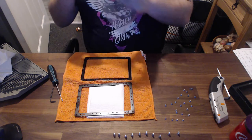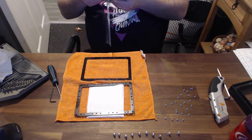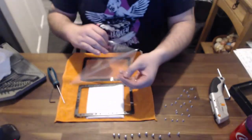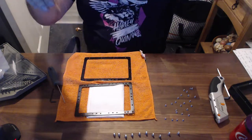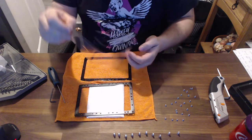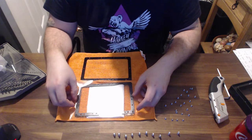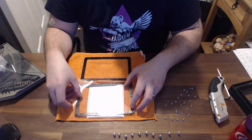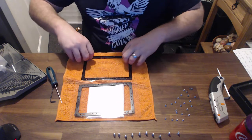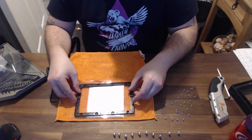I've got my new FEP sheet out and I am peeling off the protective film — there's a protective film layer on both sides and it's a little bit tricky to get off. Whatever you do, don't put the FEP on with the protective film still on either side — that will not go well. What I'm doing now is laying that on top, just very loosely, getting it roughly even so there's an even amount either side, and then I'm going to flip the other part over onto it.